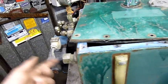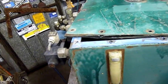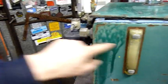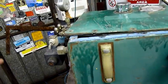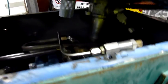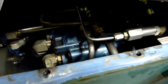I'd rather them be below the fluid level so as not to aerate it, because dumping fluid in above fluid level causes air bubbles to be churned up and drawn into the fluid, and you get air bubbles going through the pump. So anything in hydraulics and oil where you don't want air bubbles in the system — have your returns below fluid level. In this case that would be almost up to here, but that's still a little bit high. The filter on the pump appears to be down the bottom there, so it's not a huge issue. There's a filter on there — that's the suction side on the far side. And there's a low-pressure return hose which appears to go up to a strainer and then down. So it's got a return strainer and a pump intake strainer, and that red hose coming off the bottom of the strainer housing must go straight to tank.